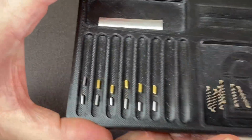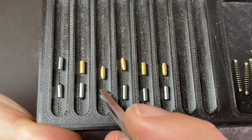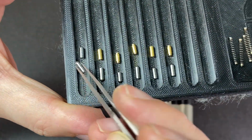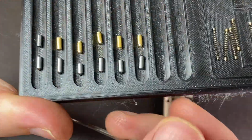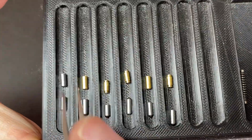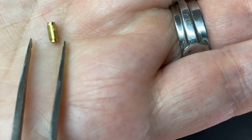Let's have a quick peek. And we have all steel key pins, and pin one of the driver pins is standard and steel. I assume that this is an anti-drill thing. There, move that around, good. So you can see that steel. Then we've got standard pin. Then looks like, that explains why I had to tap the pin to open it up a bit further.